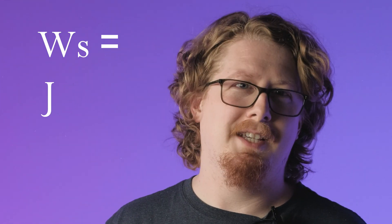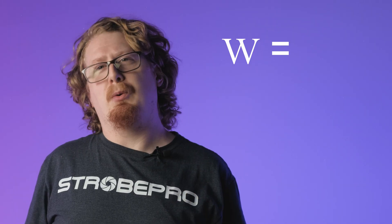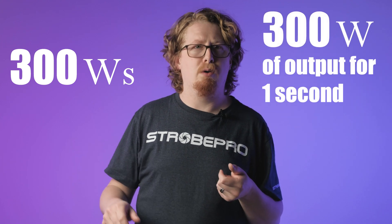The other thing about watts is that they are often confused with watt seconds. A lot fewer people would confuse watts with watt seconds if we just used the more concise SI unit that already exists to describe them. Yes — watt seconds are joules, a measure of total energy. A watt can be rewritten as a joule per second, or a watt second per second — the seconds cancel each other out. Watt seconds are a measure of total energy, while watts are a measure of total energy used per second. Strobes are measured in watt seconds because they release all of their energy over a very short period of time stored in their capacitors, while continuous lights are measured in watts because they consume energy continuously. So 300 watt seconds would be the same amount of energy that a 300 watt continuous light would use over one second.